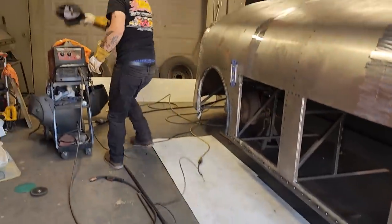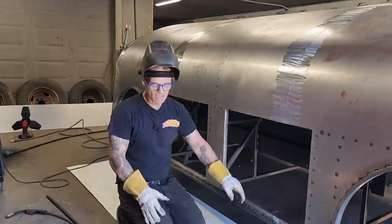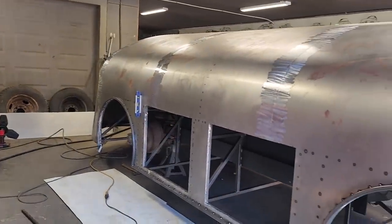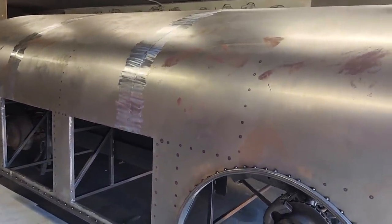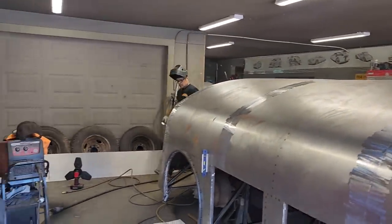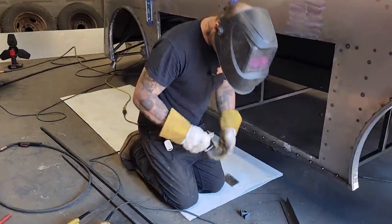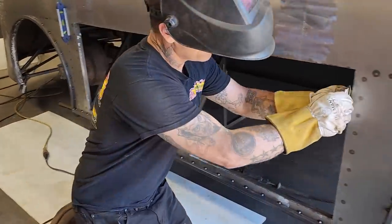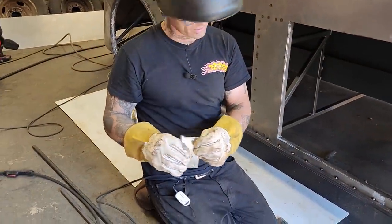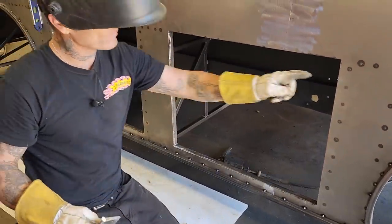Turn the welder on, let's tack them in the corner. See what we can get rocking and rolling here. Now the hinge that I have going in here, I'm gonna grab a hinge right with you. So these are the hinges that were brought to me. I can cut them off at any point I want to. Hinge, just like anything else. They're close to 3/16 for the gap that's gotta go in there. I gotta have quite a gap to get them in there. And that's fine, I want the same gap all the way around.